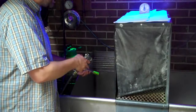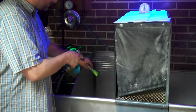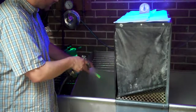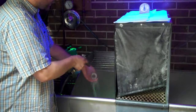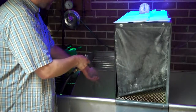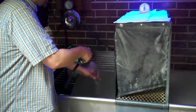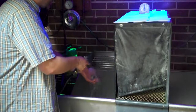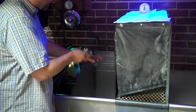For fluorescent water wash, we keep our coarse water droplets back about 12 inches and just spray our penetrant off here. Try and get as much off as we can, try and get as much out of the center as we can without getting too close. We don't really want to be down inside of here like this, or spraying directly on the part like that — it's not that great. So staying back about 12 inches — that's all good, that's all well.